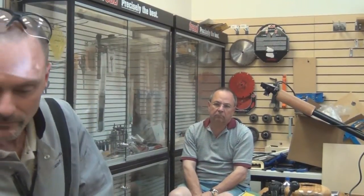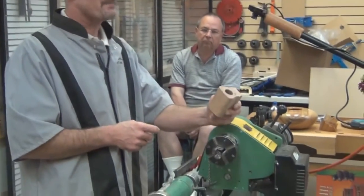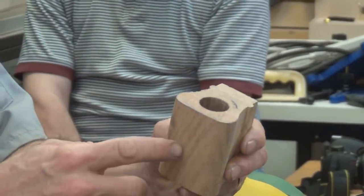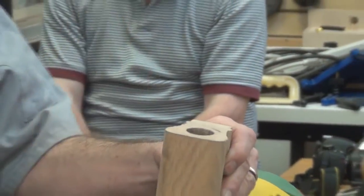I'm not going to do any casting. I did that last month, and I'm sure everybody is pretty familiar with what's needed to happen. What you need to do is pour yourself basically a column of pewter, 7/8 of an inch in diameter. And the mold that I made for that was a scrap piece of wood, and I drilled a 7/8 inch hole with a Forstner bit and just poured the pewter into that.